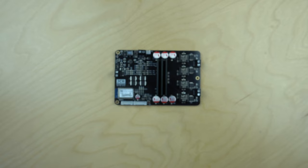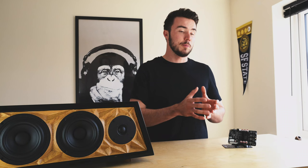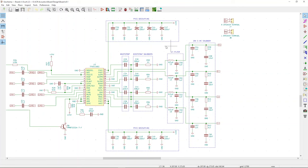You may also note the bank of capacitors top and bottom feeding into the amplifier power in. Decoupling capacitors prevent the voltage from dipping so that your amplifier always has constant power. Capacitors are kind of like batteries but able to release their stored energy very quickly. Think of a battery as a tank of water with only a small tap as an outlet — capacitors are more like a bucket, comparatively smaller but able to discharge much more quickly to meet the demands of peaks and troughs in the audio signal. Having several in parallel provides greater capacitance while also lowering impedance to attenuate noise, and tends to be cheaper than one large single capacitor.